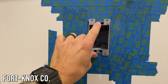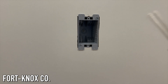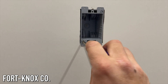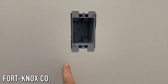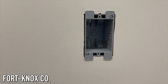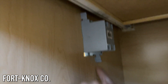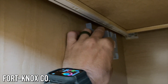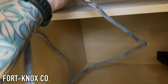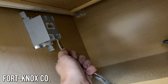You can see there's very minimal clearance and now all you have to do is tighten it down. These old work boxes are really cool — they work on drywall, they work on these cabinets. All you have to do once you have it fitted in is turn the screws, it'll tighten up. The little tabs on these old work boxes pull up against the material and secure the box. Then all we have to do is take our electrical that we've run up through the ground and feed it back into the box.